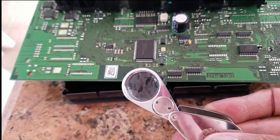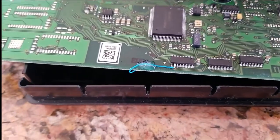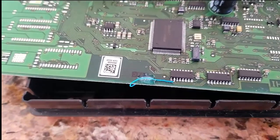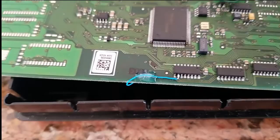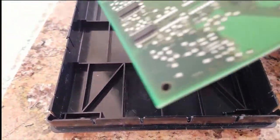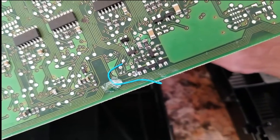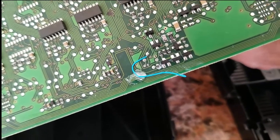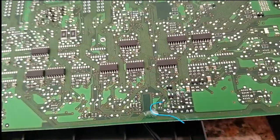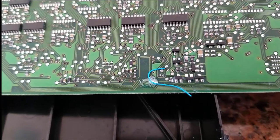That's probably due to corrosion. What I did was I put a bodge wire in there to connect the B terminal of that little multiplexer unit to the other side of the board — this is where it needs to connect to. The via hole normally connects it, but this time the via hole cracked and broke. You've got to hot glue the bodge wire down because it'll vibrate itself free.